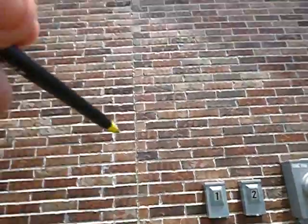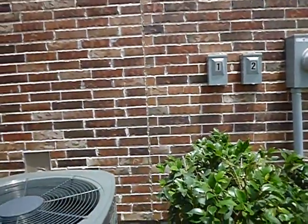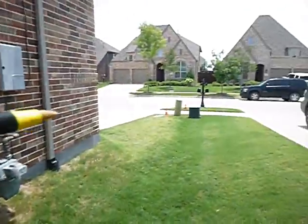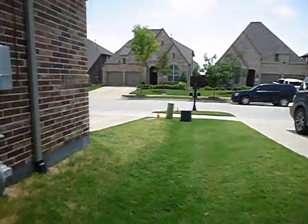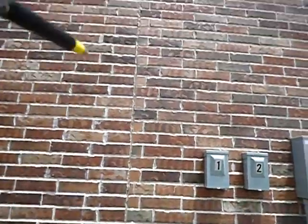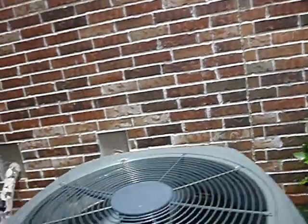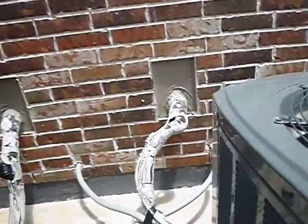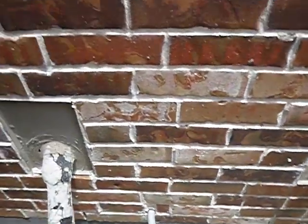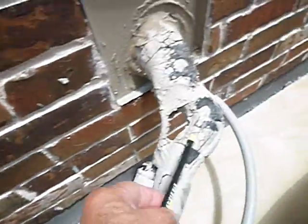These are control joints. Some people call them expansion joints. Call them what you will, but we expect the structure to move. We have control joints in the streets as well. Every year or so, you should come out here and check the sealant in that, because you don't want it cracking, shrinking, and pulling away. Like this sealant has. I mean, they sealed it up at one time, but that needs to be resealed right there, that hole. It needs to be resealed.